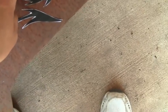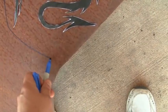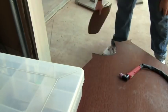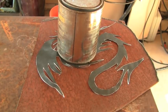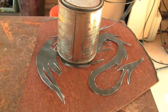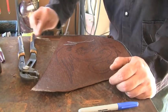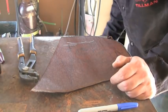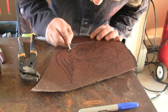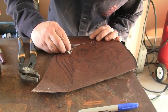I've got this piece of paper with a dragon I copied from the internet. I think you can copy and use it as long as you don't sell the pieces — not sure. I placed it on the sheet metal and traced around it. I used a vis-a-vis, which is a transparency marker — I shouldn't have used that; I thought it was a sharpie. A better choice is soapstone sharpened to a fine point, or a silver prismacolor, which they sometimes sell at welding shops. On rusted metal it really stands out well when you're cutting.